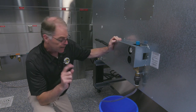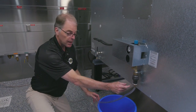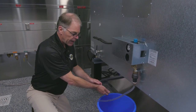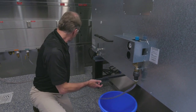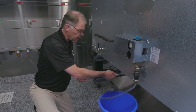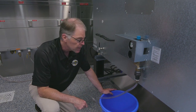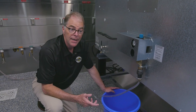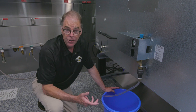The first step is your clean water line. Before it's actually connected to the oven, you'll want to have a large bucket — five to ten gallons — and you'll open your valve and let the water flow freely into the bucket to make sure it's free of debris, especially in a new construction setting that might have drywall or construction dirt.